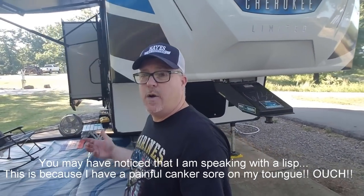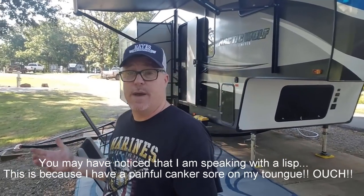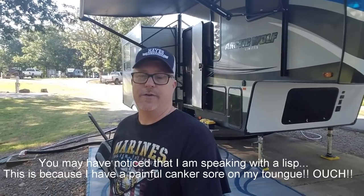That may take a few minutes, but eventually you'll hear the water come out and it'll stop spitting and sputtering. Just for good measure, I did that on my cold water side too. I opened up the cold water, then went into the bathroom and opened up the hot water and let all the air come out. Did the same thing with the cold water, then went into the kitchen and did the same thing. Then I shut all my faucets back down, turned off my water pump, hooked my city water back up, and that solved the problem.